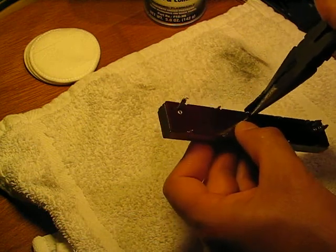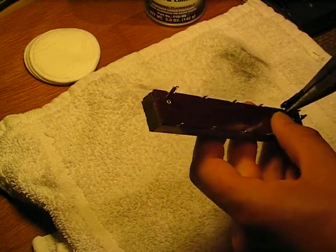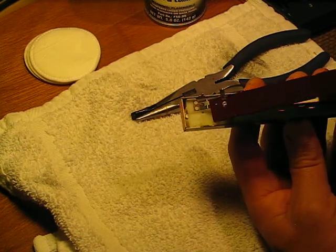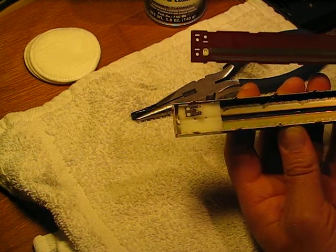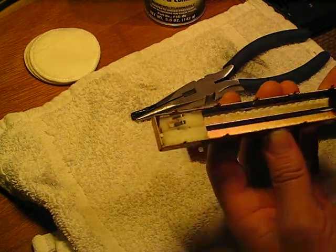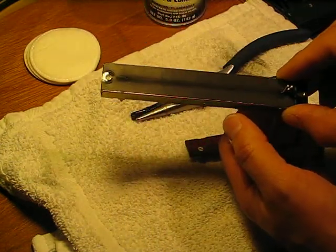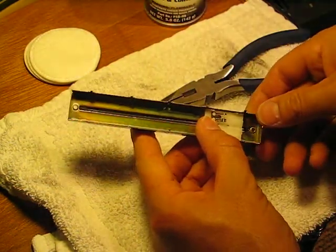When you get this opened up, note which way things are pointing so you get them back in the right way. You're going to take the element off and then you'll see what I call the carriage — it holds the wiper. This is the wiper here: the metal contacts, little filaments that go up and down your resistive element. I'm noting that this is the bottom of the fader because the gasket is open more there — it's spent most of its life down at infinity. So I'll remember that the wiper filaments point toward the bottom of the fader.